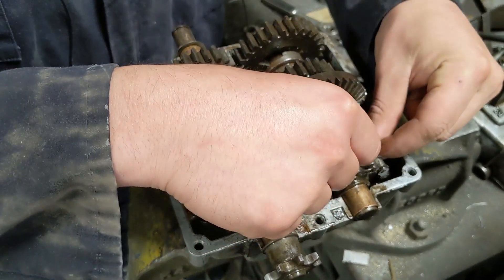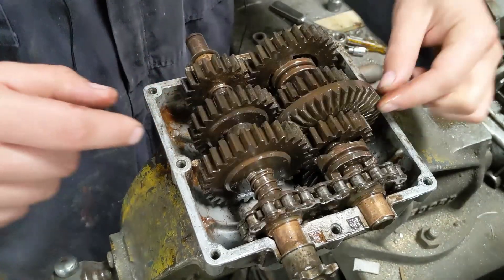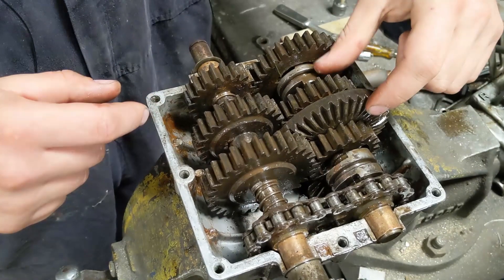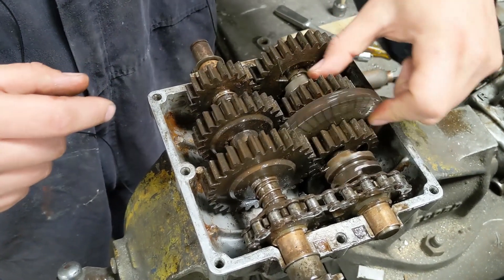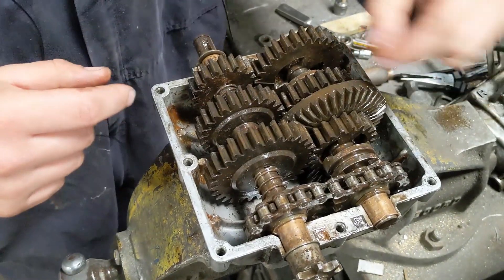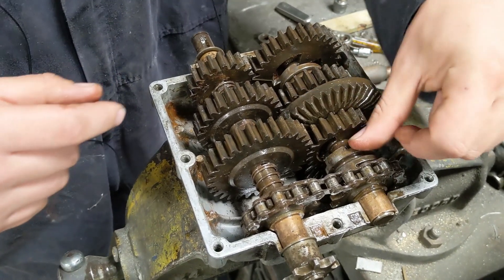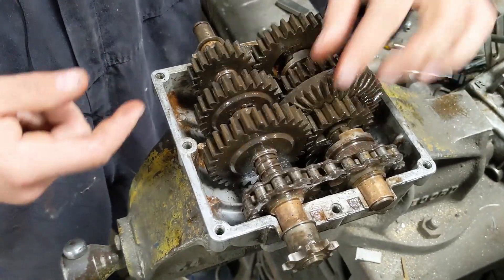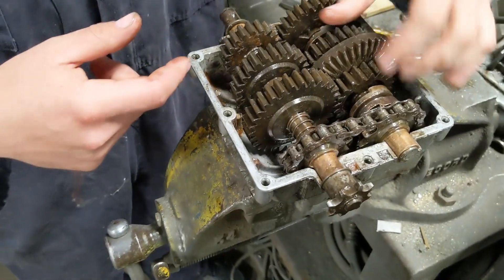If we disengage that and put in here, it's this big gear to little gear, so that would be the top gear, like so. Then of course changing gear would be back into neutral, and then somehow — there we go — it slots back in here, which is wonderful. And then this one's got a reverse system: we move this one across, it gets in there and changes this chain drive, which then changes the transmission to be the opposite direction.